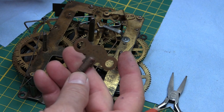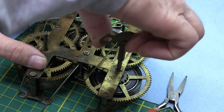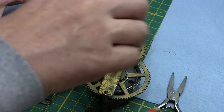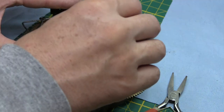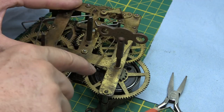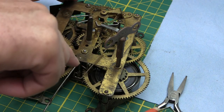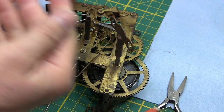You can use the key, but I don't suggest it, because when you're winding it, if the click breaks and the ratchet, this is going to spin around super fast. And if you don't have a firm grip, these wings when they spin around can take flesh off. So I use a let-down key — apparently it's a number six with interchangeable bits. You just put that on, and when you're tightening it, if the click and ratchet breaks and it starts spinning, you can control it. It's not going to hurt you.